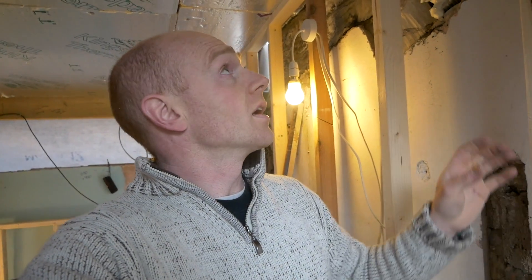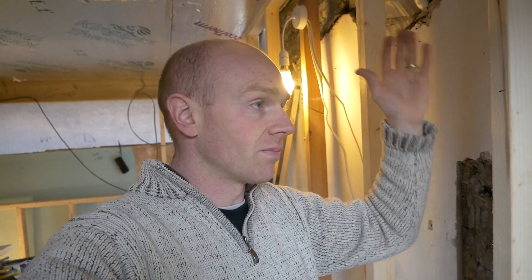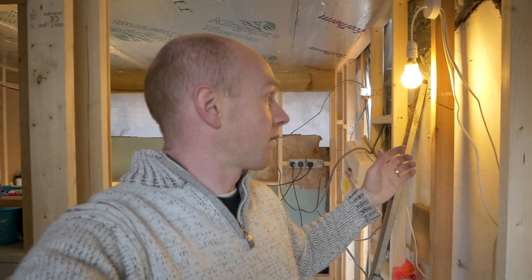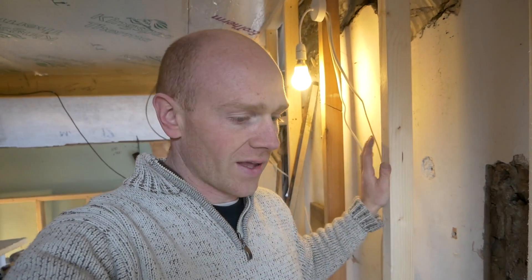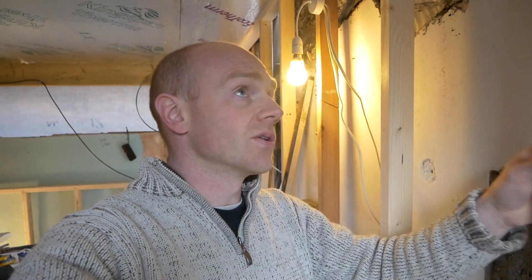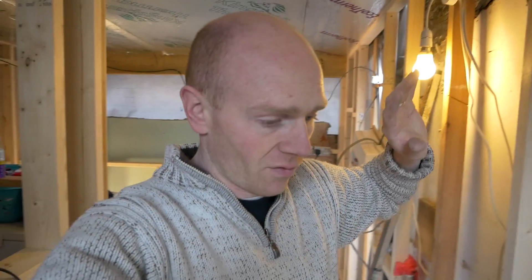Not much footage this morning — dad came over and gave me a hand and we've really plowed through a lot of the stud work. We've used pretty narrow studwork here, three-by-two or 63mm, and that's given us enough of a standoff from this wall to even things out, because it was an old stone wall. There are also a lot of services running along here, so although we've lost quite a bit of room, it'll speed things up. There was no way we could just skim on here — up here there's the old flue and lead work from the old roof.